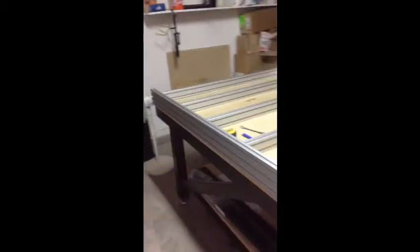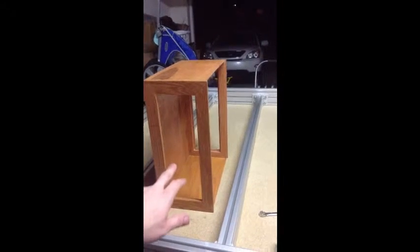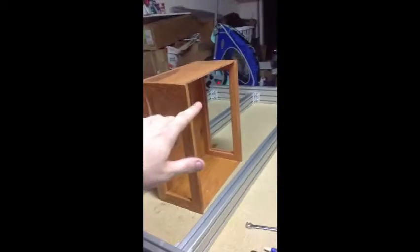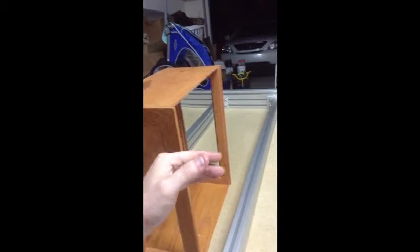Okay, that's where I'm at so far. Sorry about the bad video quality — I'm using my iPad. Let me show you another quick thing I'm working on: a little electronics enclosure for my G540 and my power supplies, just made out of wood. I'm going to put some plexiglass windows in here on the sides, put some fans on the top, have all the cables in the whole system come in through the top, then put the Gecko on the front face and have the stepper wires come in through there and out a hole in the front into the Gecko. So everything routes through the top of this box.